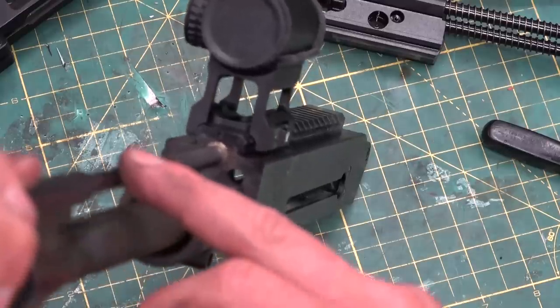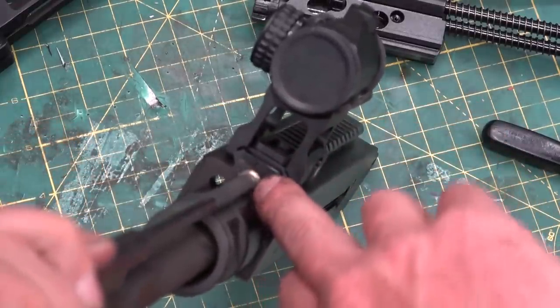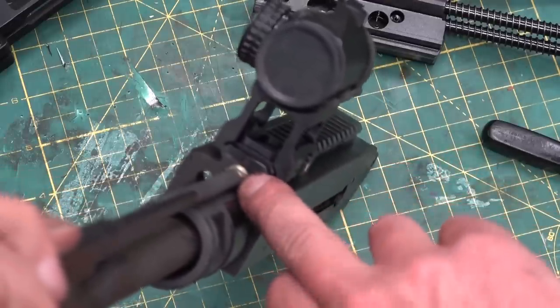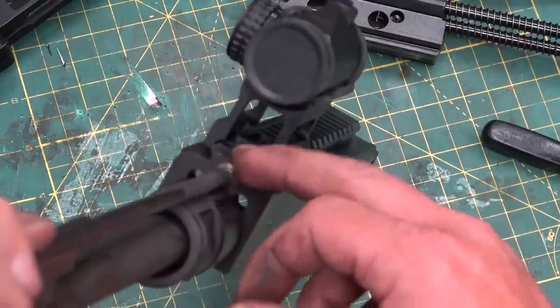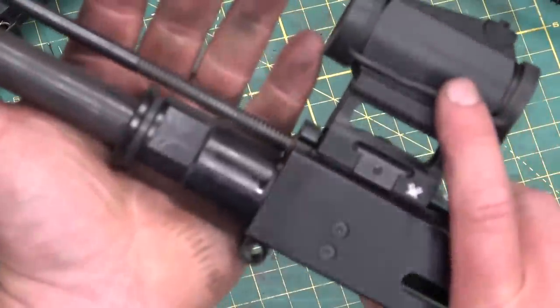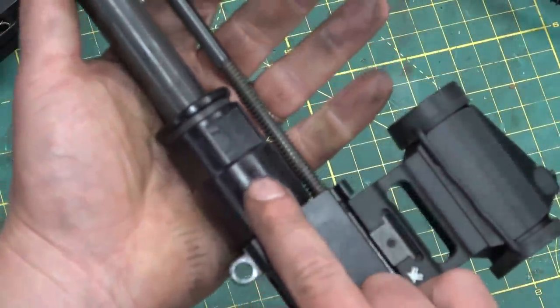And that gas actuated spring return piston, that rod goes through the upper. There's a bronze bush there that it rides in. It'll need to be lubricated. Of course, you get a hard pin through something soft, and the soft part wallers out. Different, must be a different crew or a different sub making these. What would you call that?